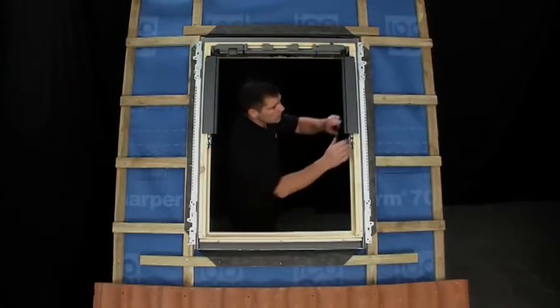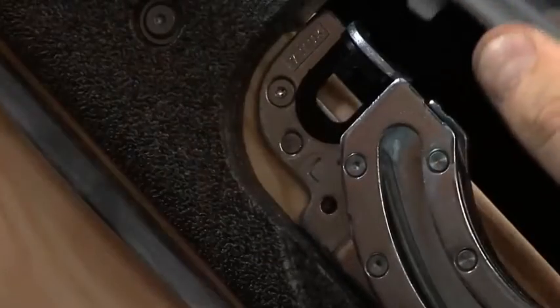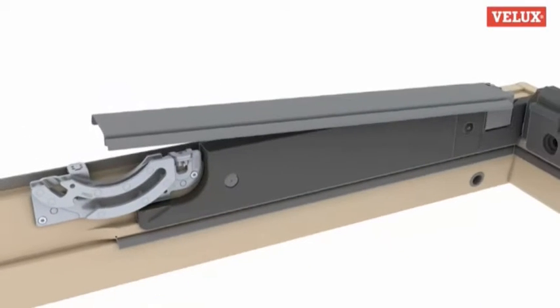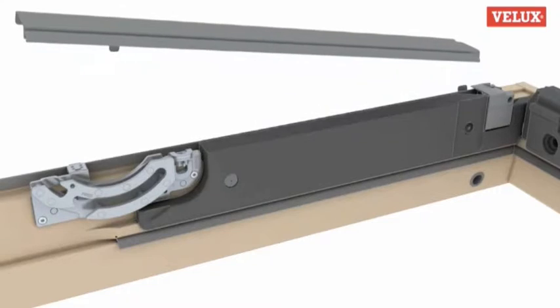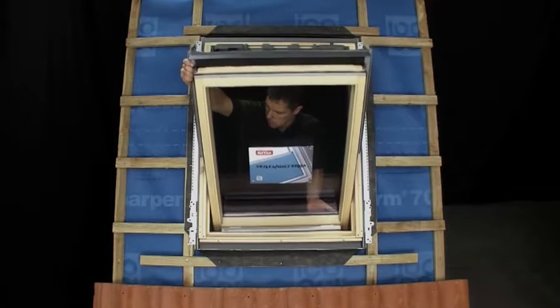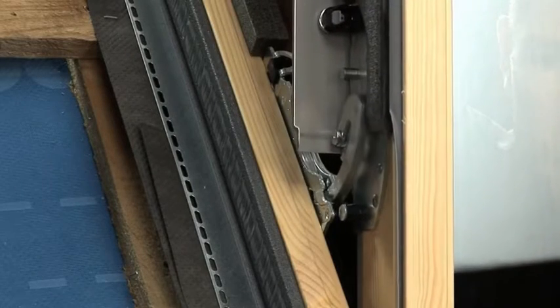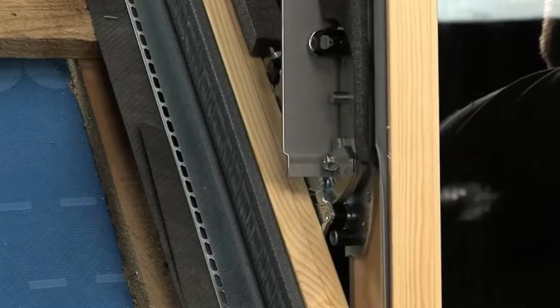The Part 5 flashing parts can be removed at this stage if you find it makes it easier for you to take the sash in and out of the frame. These are unclipped using the plastic fixing on the underside of the cover part. Replace the sash into the frame by lining up the curved hinge pieces of the sash with the corresponding slots on the frame.